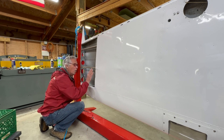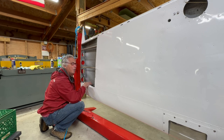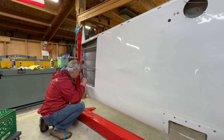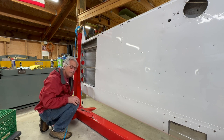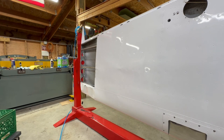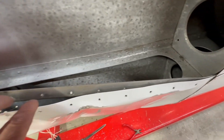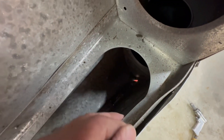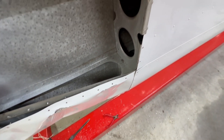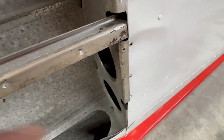I was curious what would actually lay down once I had that relief off of that. The top fork isn't bad — there's a little bit of damage, a little bit of bend in it. This bottom fork could need some work, but I think it'll straighten out. See, this bottom fork bent right here, but that'll straighten out — it's not torn. The stringer doesn't look bad. There's something going on right here and it may be a case of being able to rub that out if this isn't damaged. We'll have to get in there and take a look at it.